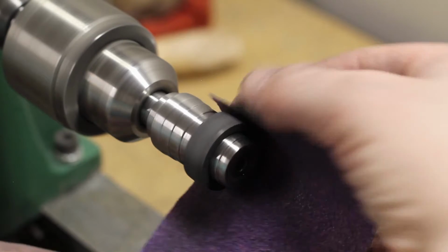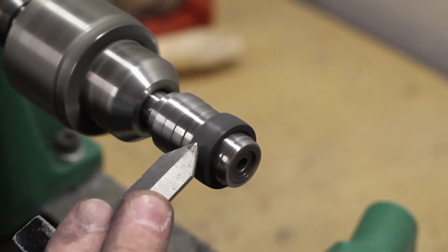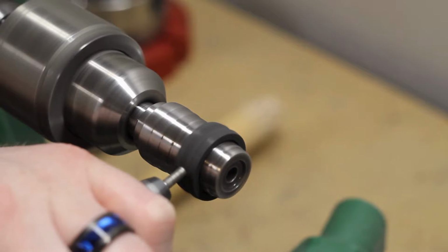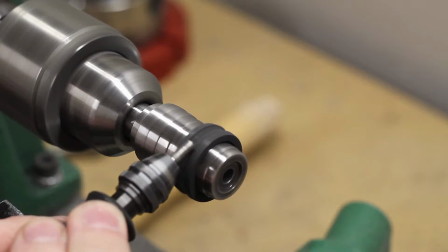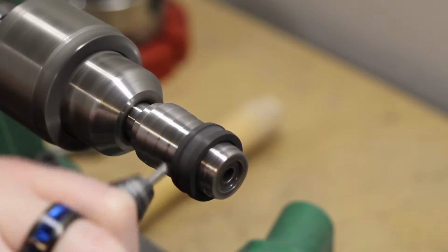And to show you how strong the carbon fiber is, here's a normal lathe tool. I'm trying to put a gap in there. So a normal lathe tool is not going to work very well or at all. So I actually just took out my Dremel and have a round diamond bit on there. It is going, and so we'll just use that to cut out our groove. Makes it a lot easier.